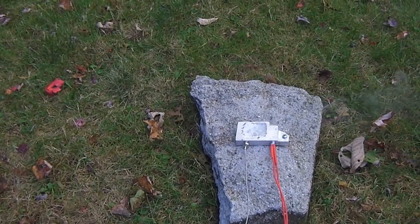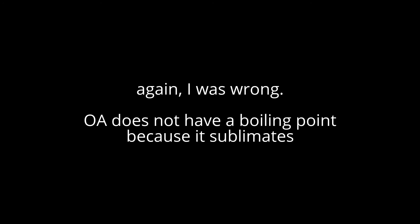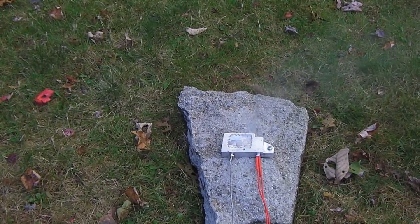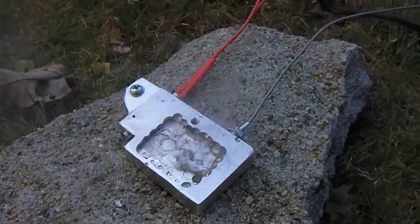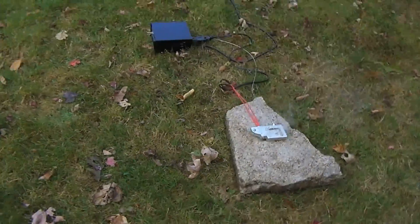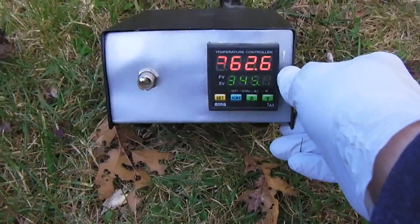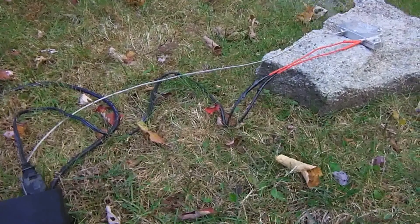Now we have what looks like boiling oxalic acid. Trying to get away from the fumes here — apparently that's what it looks like. That's happening at a set point of 360 degrees — or rather, I had the set point at 345 but it overshot to 360. So that could be close to the breakdown temperature, but it is vaporizing successfully.